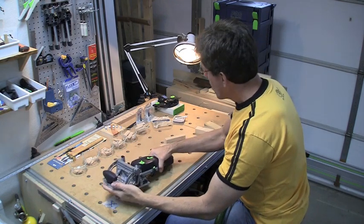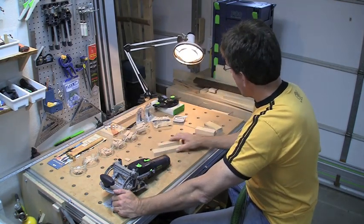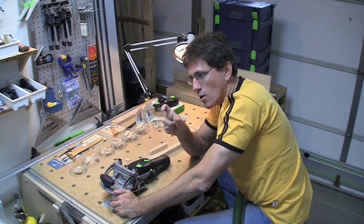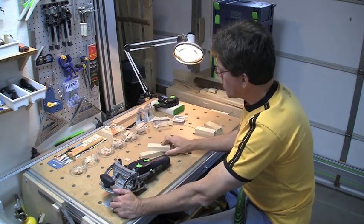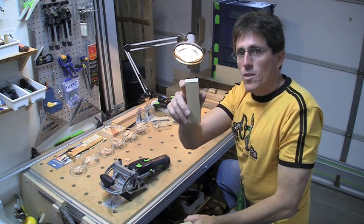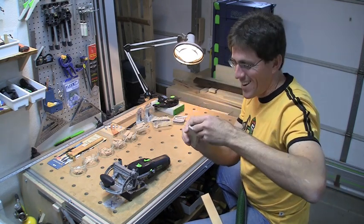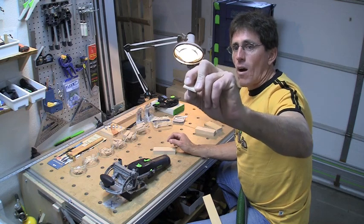For this demonstration I'm using 5mm Domino bits — the little tiny ones. One key difference from a biscuit joiner: biscuits are considerably larger and don't have that much strength because of the way they're put in — they're used a lot for alignment. On narrow stock, you'd be hard-pressed to fit a biscuit, but a 5mm Domino fits fine. You could even go down to 4mm, though that's mostly useful for jewelry boxes. Also, these are steamed beech — tenaciously hard.